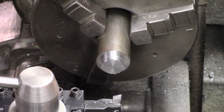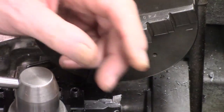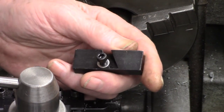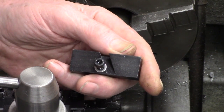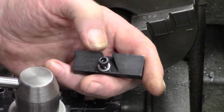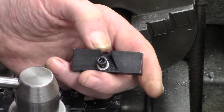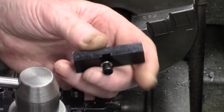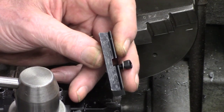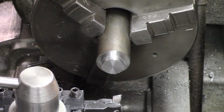And then the other thing I referred to before was this little jig. The angled section is to put the tool in and allow you to get the grind at the right angle, making it very quick — takes no time at all to freshen it up. And the back here is to assist with getting the 55 or 60 degrees for a threading tool.